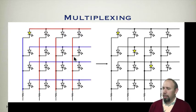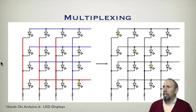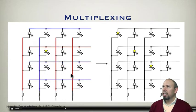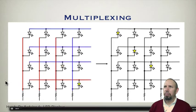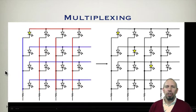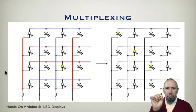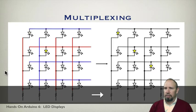And so what's going to happen is, to light the diagonal elements, we basically alternate rows and columns so that we only address, in this case, the diagonal elements. Okay, so it maybe is a little confusing, and this thing flashing black is probably not helping. But this is the basic idea. So what you might do is, with this video, move the scrubber a little bit, point by point, and then see how each LED is lit as it goes through this process.